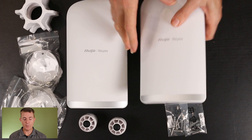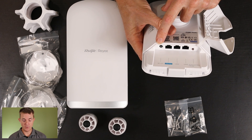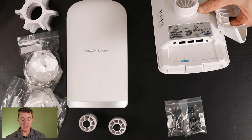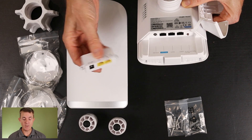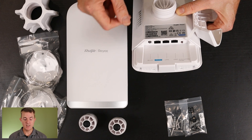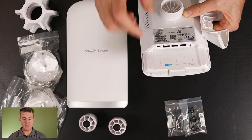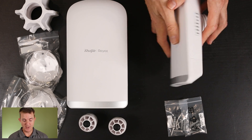These can be powered two further ways. They can be powered here by 12-volt DC, which could come directly from your battery power packs using a 2.1 connector. Then you've got your PoE input option — we can use the PoE injector and put in 24 volts, or you can put 48 volts in here. 48 volts is standard PoE for wireless access points, PoE switches, cameras, and those types of things. So we've got three ways of powering it: 24-volt PoE, 48-volt PoE, and 12-volt direct input.